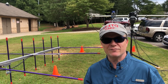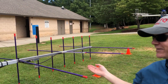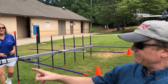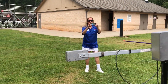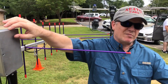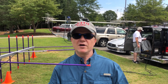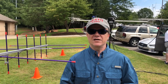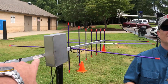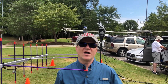I'm Eddie Thompson, AE4TQ from Marietta, and I'm going to tell you about my Mini Azimuth Elevation antenna. It's the Arrow antenna, the smaller variety — there's a much larger one with 70 centimeters and 2 meters. There's a little counterbalance at the end to make sure it's absolutely balanced so it doesn't strain on the motors. Inside the box is an Arduino microcontroller, which is fed by a Raspberry Pi computer for controlling with G-Predict. G-Predict is satellite prediction and control software — it will do the antenna controller and the rig control for Doppler. You could use the software to automatically have this antenna track the satellite as it goes by, and also compensate for Doppler shift on the radio. Uplink and downlink simultaneously.